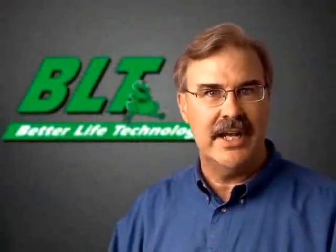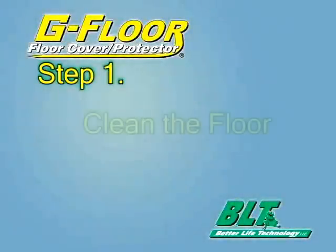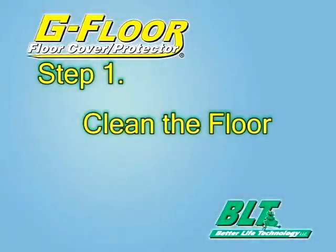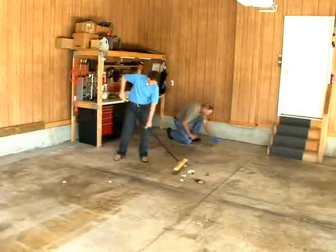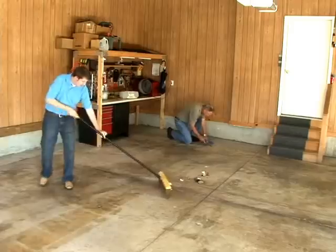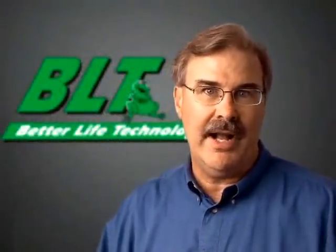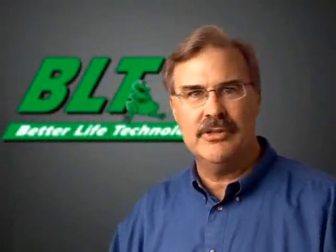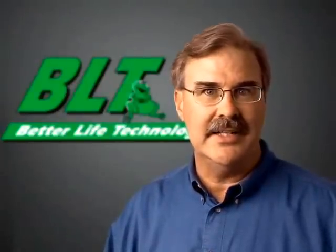You're now ready to begin the installation of G-Floor. Step 1: Clean the floor. Sweep the entire floor, making sure it's clean, dry, and free of any debris. A small object, while not likely to damage G-Floor, can leave an unsightly blemish. Examine the floor for large, uneven cracks or defects. Hairline cracks are not going to be a problem. Fill any holes or cracks as needed.